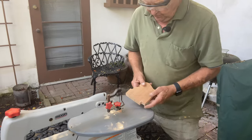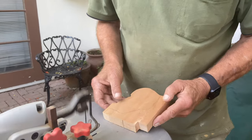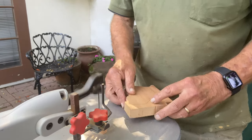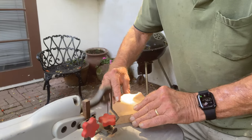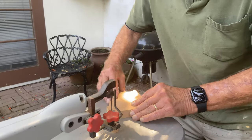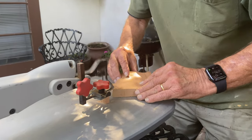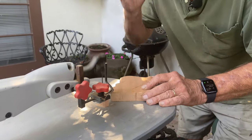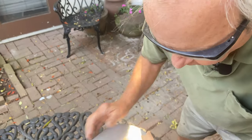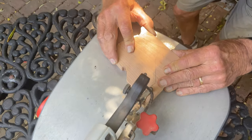What we really want to do with this kind of saw is go along curved surfaces. So let's try to cut along this curve and demonstrate how you do that. When you come to a curve, you move the wood and try not to pull the blade left or right very much — try to keep the blade centered. As you get a little experience, you'll find it becomes much easier. We're cutting a curve here, and we simply follow the curve with our eyes.